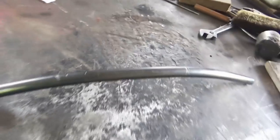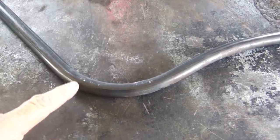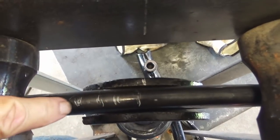The way I bend this pipe, I put some marks about a half inch apart at spots I want to bend. This particular bend, every half inch I had a mark. And I put it in my pipe bender — I got a mark on the die and some marks on the pipe right there where I want to bend it.